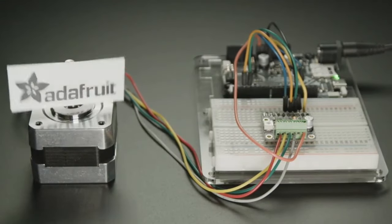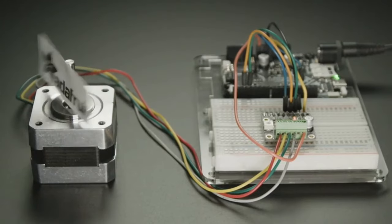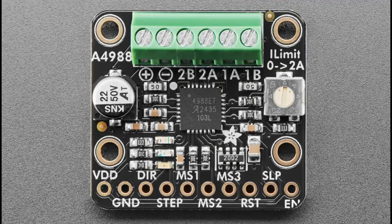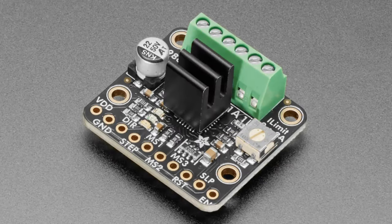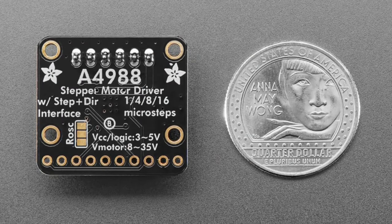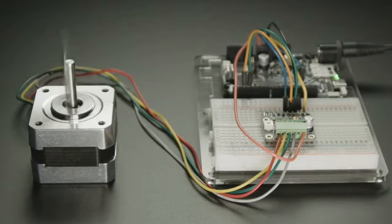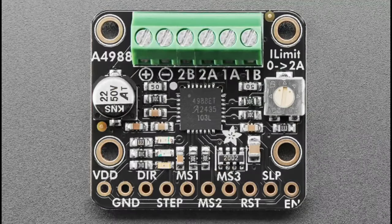It's a spinning motor connected to a motor driver chip. We've had motor drivers before that were just plain H bridges, but some people asked us to carry stepper motor driver chips. These are specifically designed for bipolar steppers. They make it really easy because they do the micro stepping support for you, and some of them even have debug signaling or UART control. This one is the first one. It's the most popular and simplest, called the Allegro A4988. It can drive up to 2 amps of current into an 8 volt to 35 volt bipolar DC motor.